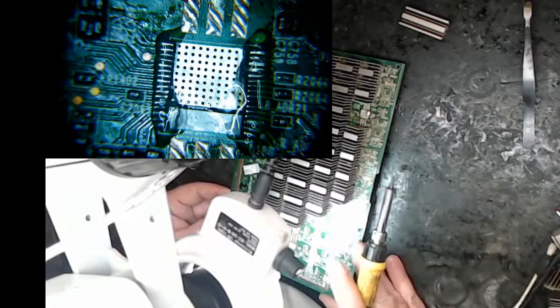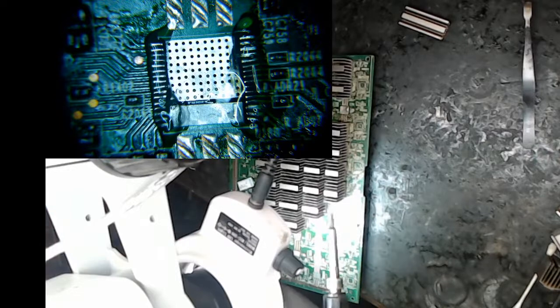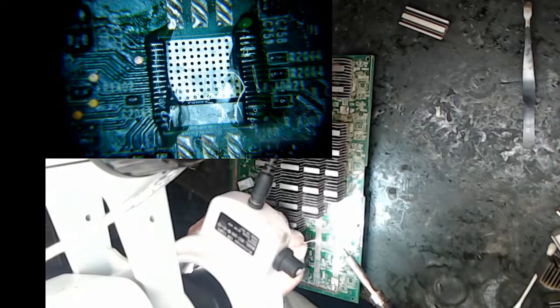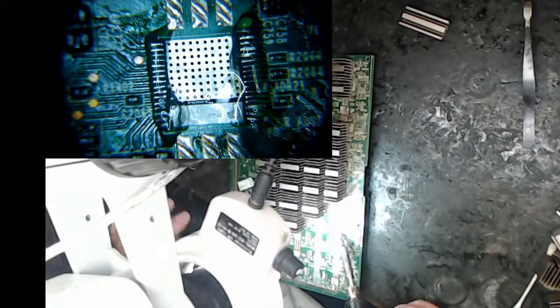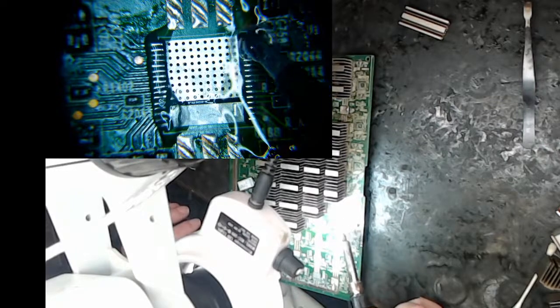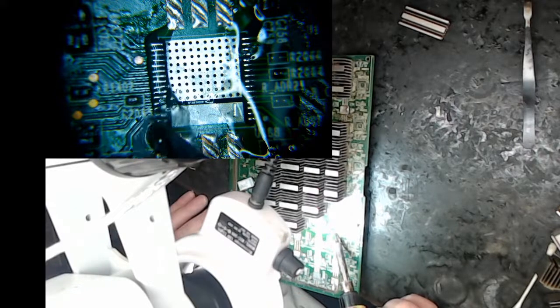So lately I've been doing this. I'm going to put some solder on here on my flat spot. I rotate the iron until I find that flat spot. Throw some solder on there, and then I just kind of drive along here. This S17 always causes problems here, so I just kind of tap it here and get some solder there. And I drive it along here.